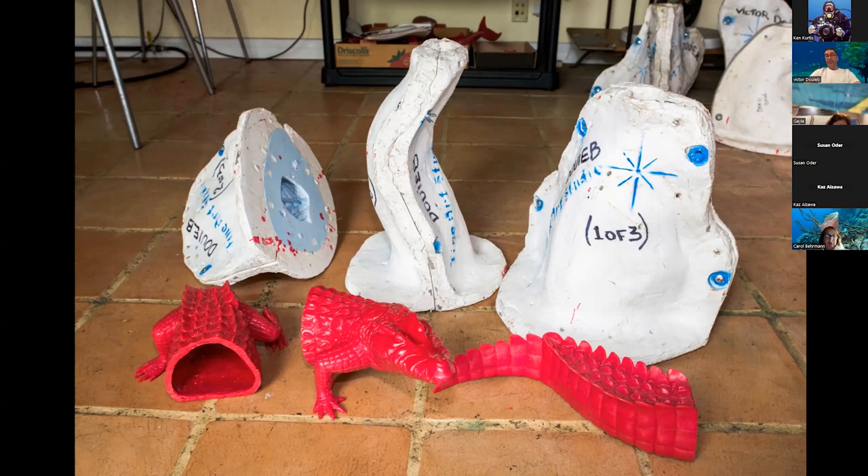When I remove the wax from the mold, I sit down and spend maybe another week re-detailing, because you lose a little bit of detail when you pour the wax. For this edition of eight crocodiles, as the edition progresses I pour more wax into the mold and lose more detail each time. So I actually spend more time on the second, third, and fourth pieces all the way to eight, keeping adding time to really detail those pieces.